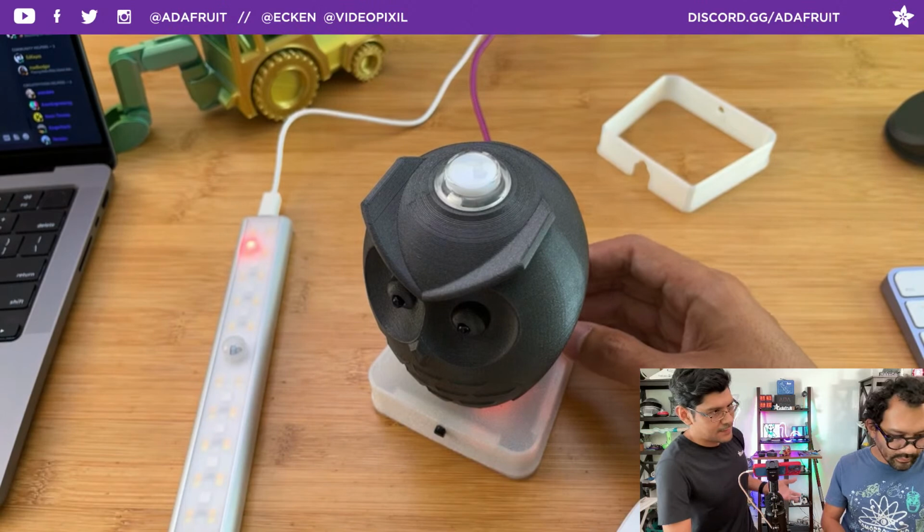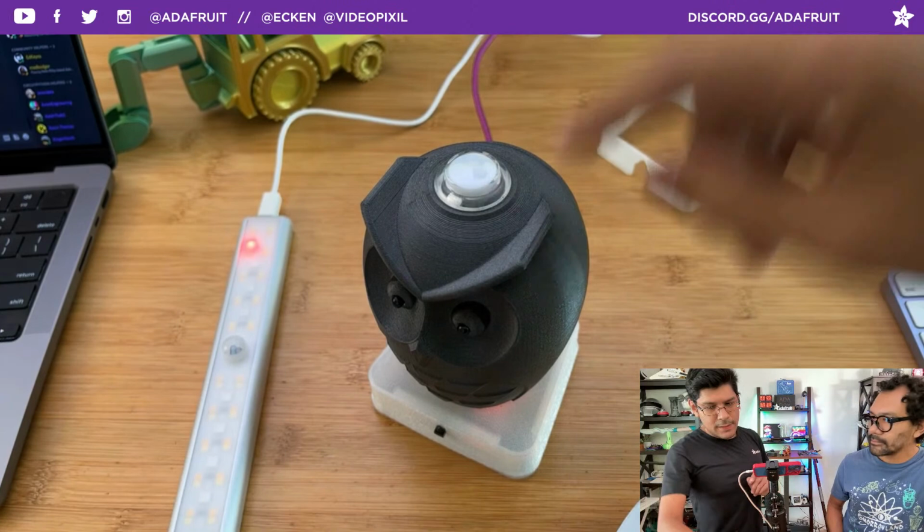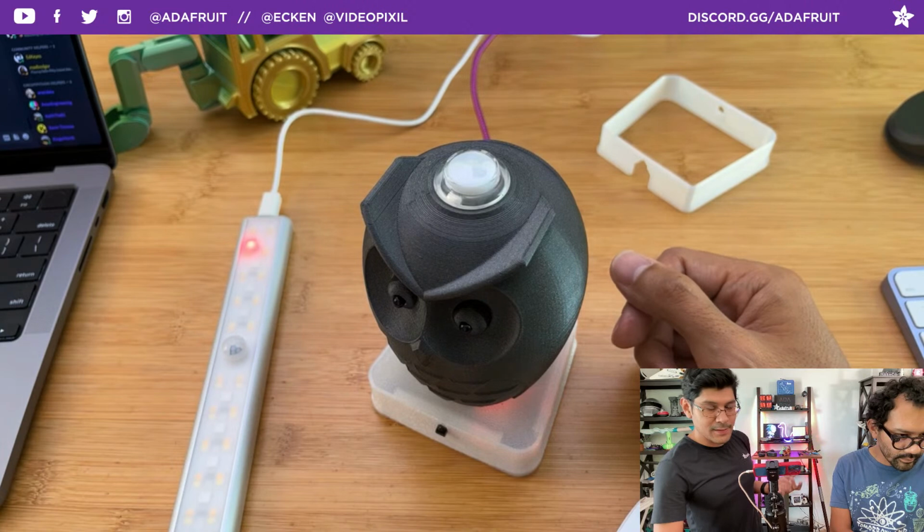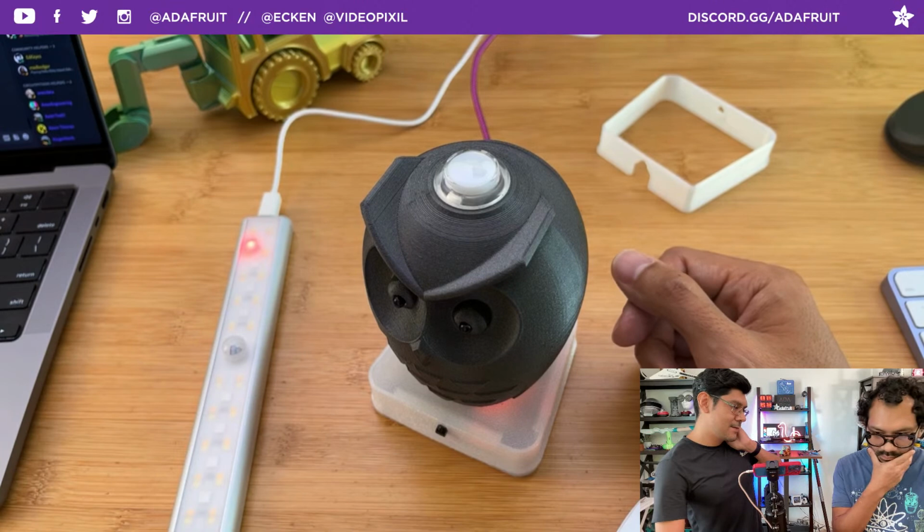The nozzle we're using is a stock 0.4. I think he's asking what temperatures we're using. Sure. We like to go a little bit hotter, so 210 to 220 C on the nozzle and like 60 C on the bed. We use a powder coated PEI flexi build plate for our Creality CR-10S Pro. Smart Pro. The V2 is what I used.